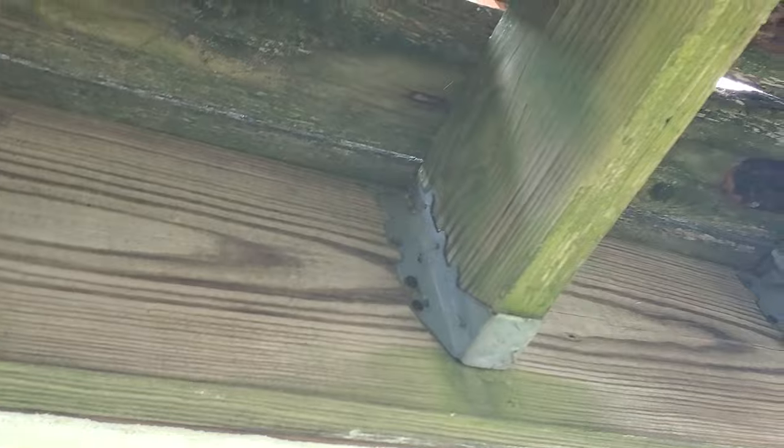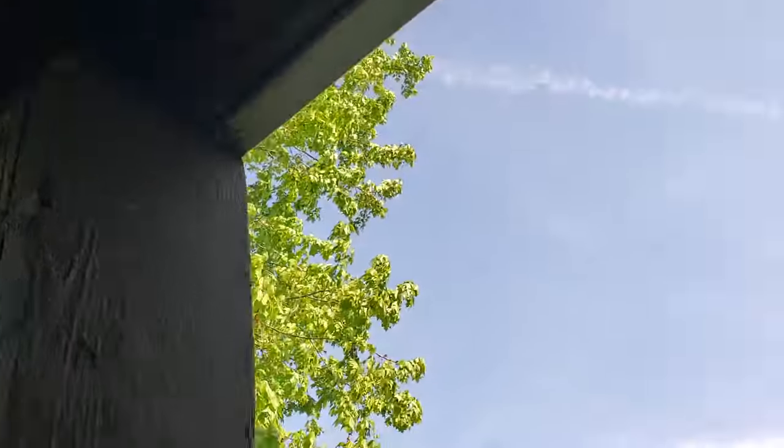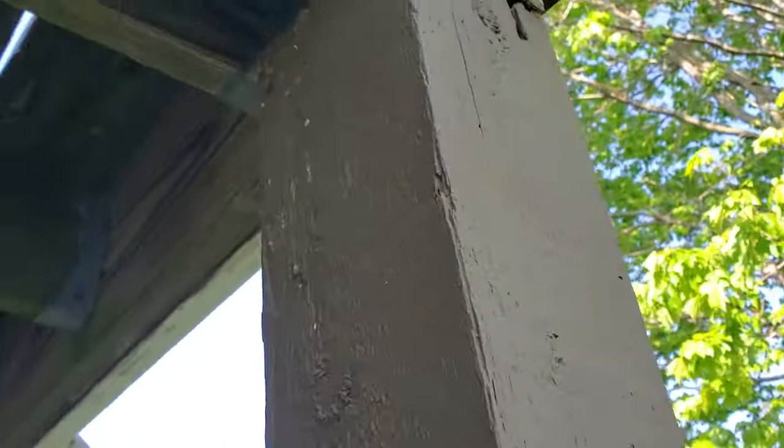But now look at the rusty nails. First, what we have is we just ran out of floor joist hangers on the other side, and we just grabbed whatever's left in the bucket. We must have run out of nails too, because we didn't use the right nails. You can always tell if you've got the right hanger nails because they don't rust like this. This is really, really bad. People are depending their lives on those nails.